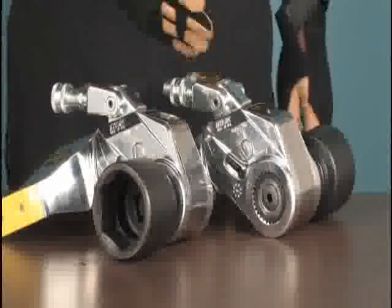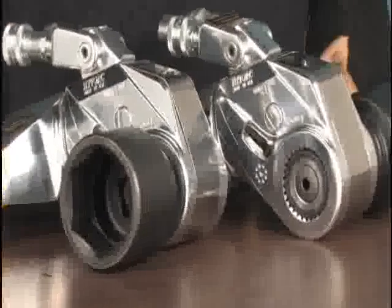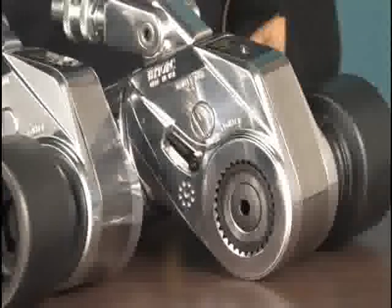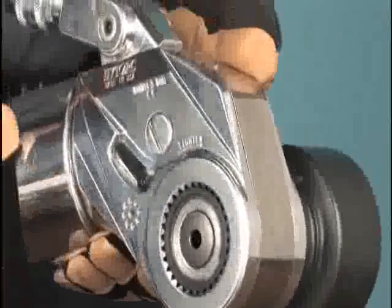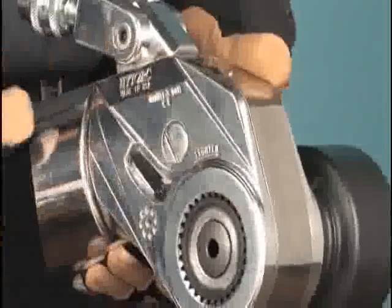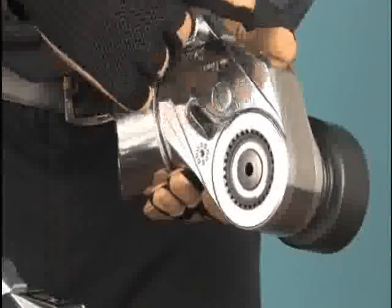The direction of the wrench — whether to tighten or loosen — is determined by which side of the tool the drive and socket are on. You will note that the drive is offset from the plane of the piston. If we look down on the top of the socket, as the piston travels forward, the drive will be turned in a clockwise direction, tightening the nut.